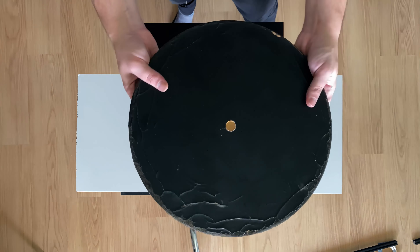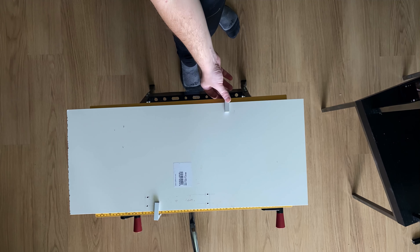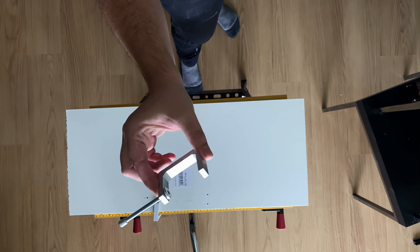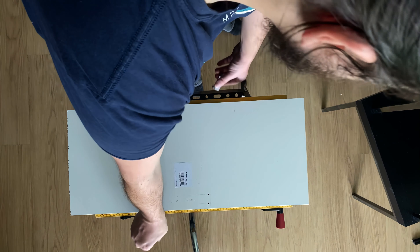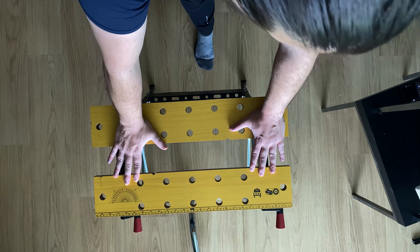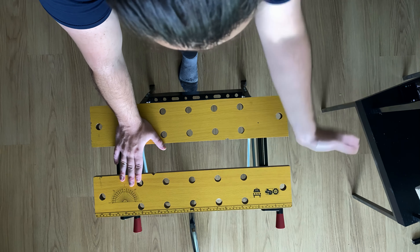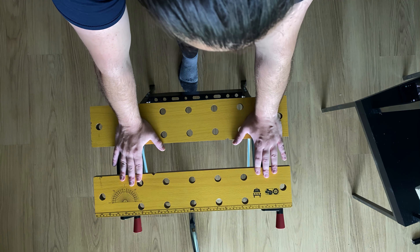To hold the extrusion frames and the Lazy Susan plates, you're gonna need some M4 bolts and M4 nuts. You have several sizes in bolts — M3, M4, M5, etc. — and it's regarding the diameter of the bolts. In this rig, I used M4 bolts to attach anything to the extrusion frames. And for tying together the bottom base board and the tabletop board, I'm using M8 bolts that are about 10 cm long.